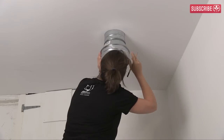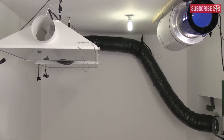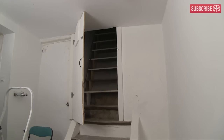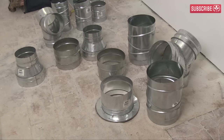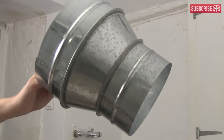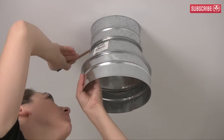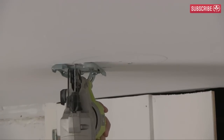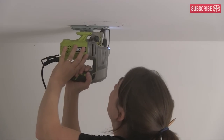The first thing we need to do is make holes to channel the extracted air. We've decided to make two separate holes — one for the 6-inch Magnums and one for the 10-inch hyperfan. I'm making the holes in my suspended ceiling and then ducting up the unused staircase out to my backyard. My local grow store ran out of the right size duct collars and couplers, so I'm improvising a little today with this Ideal Air 8-to-6-inch reducer. Use the 6-inch side to draw the right size circle. Drill a hole along the inner edge of the circumference for your jigsaw and away we go!